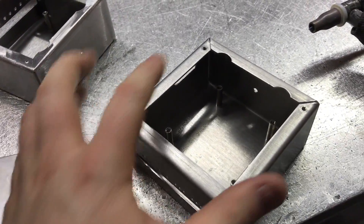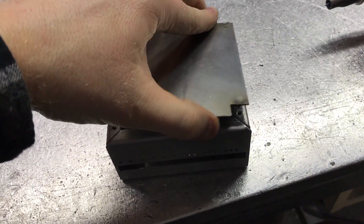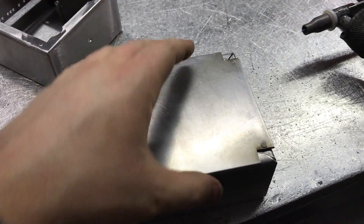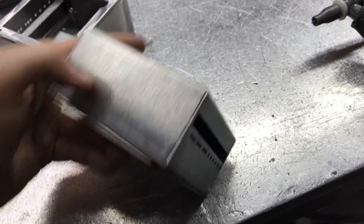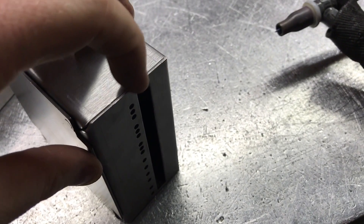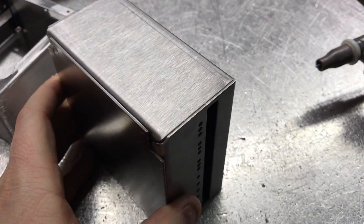The only thing I use filler for is the top edges. I use this fixture with tooling pins in it, and that's just so I can verify the hole patterns are right and that it doesn't warp out. So I'm tacking it, then for these edges — this edge and this edge — it's very easy to burn through here. So if you're going over that edge and you don't have anything backing that spot, it's easy to burn through.